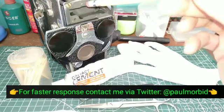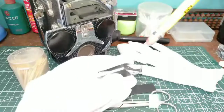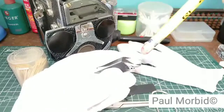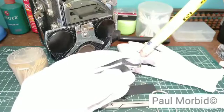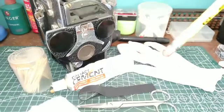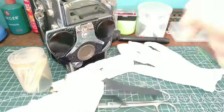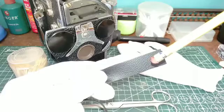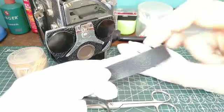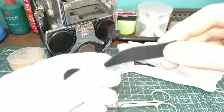One, two, three small little pads with adhesive on them to support and center the viewable image in the Bolex Rex Turret prism, also known as the transport prism. What I'm using is some Bolex pleather — the skin pleather that I put on Bolex cameras on the outside — as it's very thin and very similar to the original cork pads.